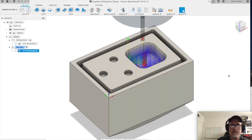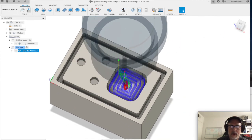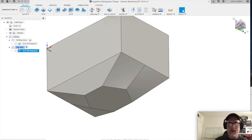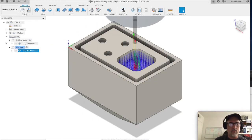Click close. I didn't do the rectangular hole here because in testing there's a little bit of an issue — it's an eighth of an inch but I need to figure out why it's only cutting one side and the corners. I need to tweak some settings. If you guys want to play around with it and can get it to cut out, share with everybody. The bottom side we'll do in a second video. You should have two setups and two toolpaths — that's it, you're done.